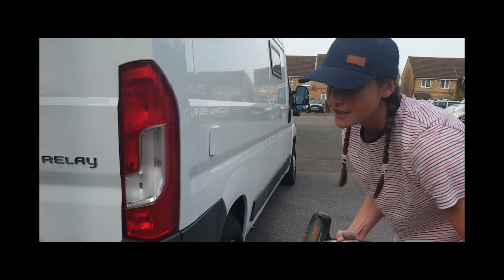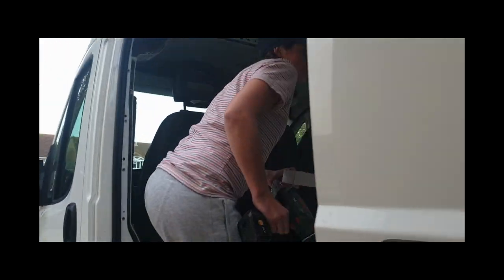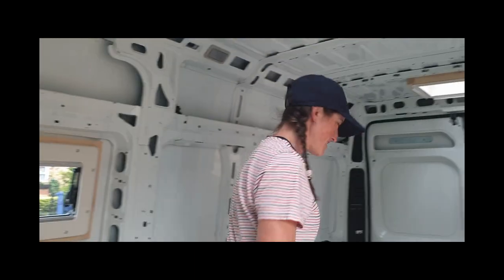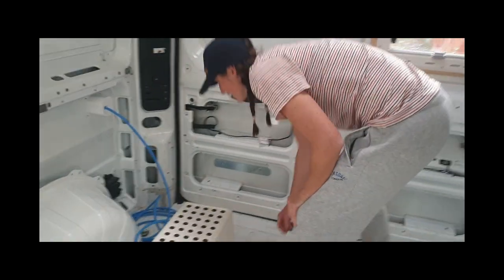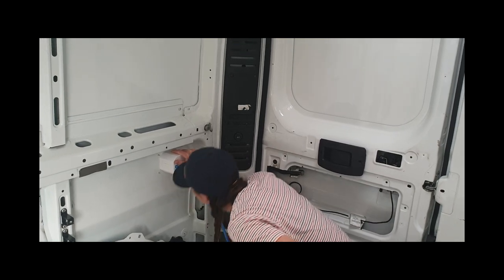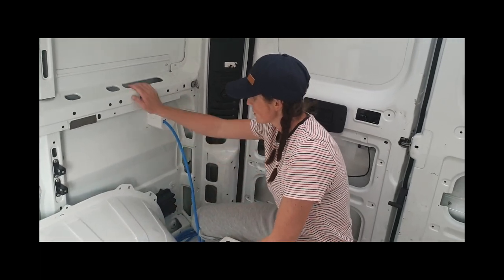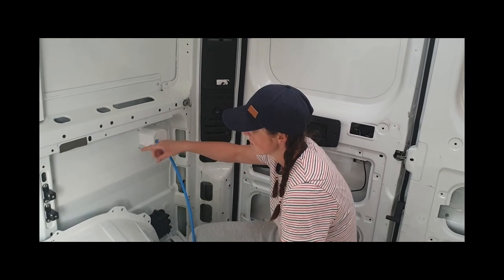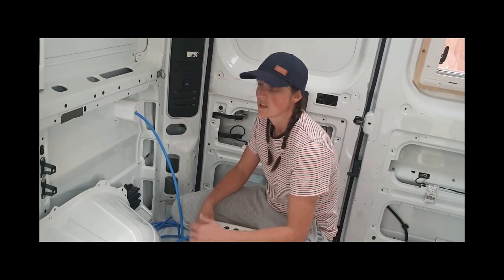We've got to go inside. That feels pretty solid. So that's my incoming cable, and then what I'll need to do next is wire up the RCD bay, take an earthing point to the chassis somewhere, and then from the MCBs off of that I can run to my plugs. But I need to get a board and whatnot so we'll come back to that.